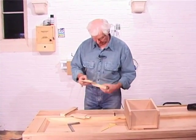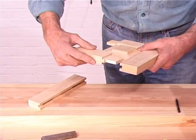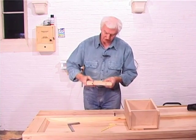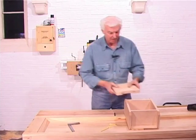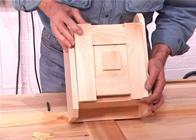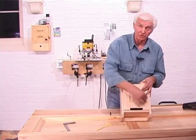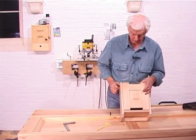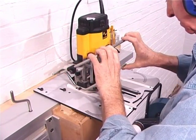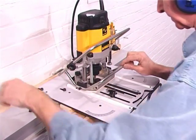Now the whole door goes together, and with any luck it should just fit in the cupboard. Of course, we'll have to cut the horns off and pin the corners. You can then go on to sink the holes for the draw pegs, and even make the dowels themselves in the timber that you are using for the door.